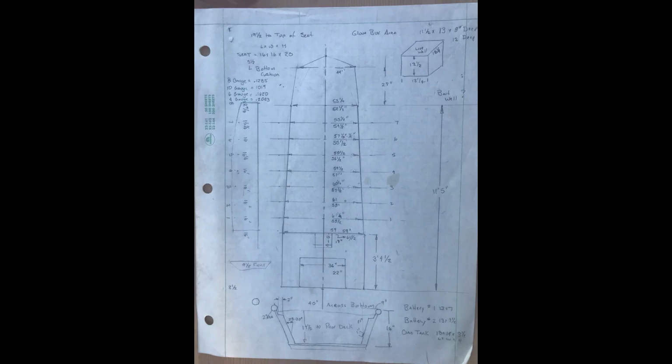So now it's time to go into the design phase of things. Now I had the boat, since I was going to take the sides from being angled to vertical so I could mount the stick steering unit, I had to go out to the shop and take some measurements of I was going to be building an aluminum profile that you mount the throttle and the stick steering unit to. So I had to determine the contour of the boat in an effort to do that. In the nerd that I am, I took all that into SolidWorks, a design package that I use at work, and entered it all in and got the contours of the boat so that I could eventually design the aluminum profile that went on the side.